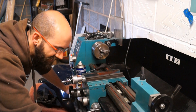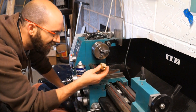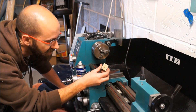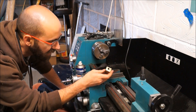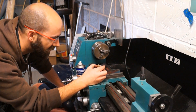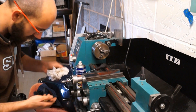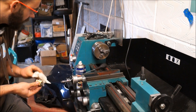I realise we've got a bit out of sequence here — I've been drilling, messing about, cutting. I had to make this significantly shorter in the end just because it carried on hooking up on the threads. So this is basically ready to go: two M4 holes drilled and tapped, everything's chamfered. I had to cut the bottom off as well because it was too deep. But it now fits on the lead screw. The lead screw's clean. I've just stoned off the edges of these two bits of casting. I think what we can do is reassemble it now — we're ready to go.